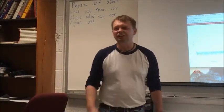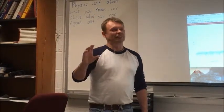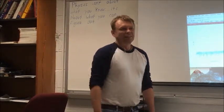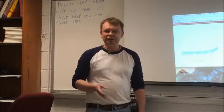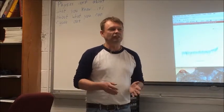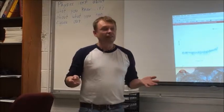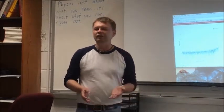Well, you have an oscillator, so you don't have to oscillate. But what happens? You have a pretty much identical signal coming back with random phase. And this signal interferes with the signal from your generator. And when you sweep, this phase difference changes. And you get an amplitude sweep from 0 to whatever, and you have no idea what is happening. So you have to take this into account.